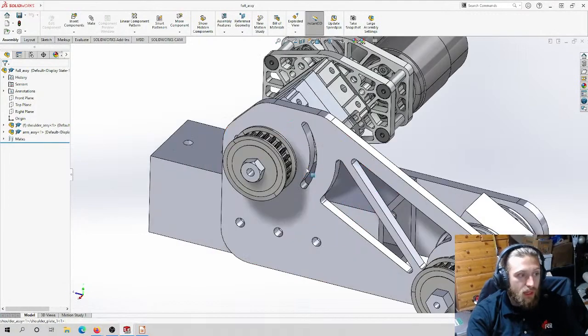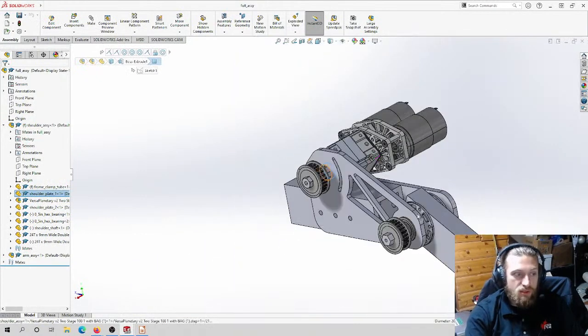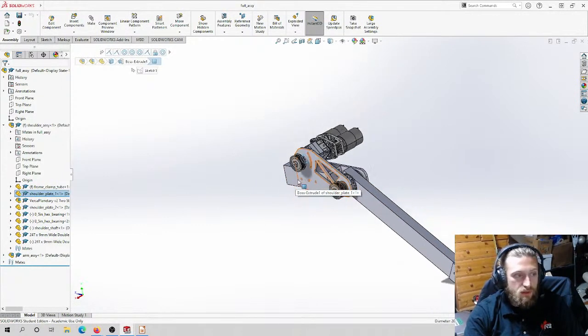What you actually have to worry about is the specific dimensions of that hole, the radius and the diameter. On the water jet, they will not be exact. They will probably be undersized by about a millimeter. So you might have to take it over to the mill and clean out the hole, or take a file to it, which is always a bit of a pain. Whereas with the CNC, those holes are going to be near perfect.